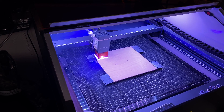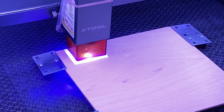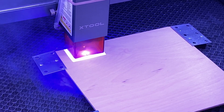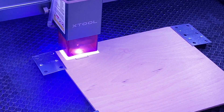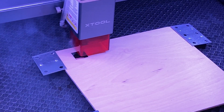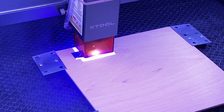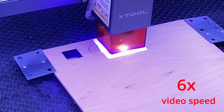One of the reasons I like using pins to support the workpiece is that when doing cuts there's increased airflow beneath the workpiece. One way you know you're cutting through is that there's a considerable amount of smoke that is generated and you can see the smoke rising from underneath the workpiece. Also very often the cut piece will drop out of the original material so that you know you've cut through it completely.